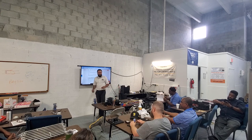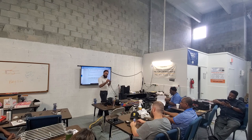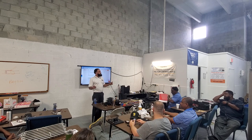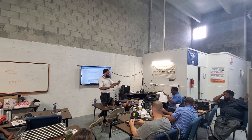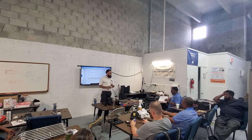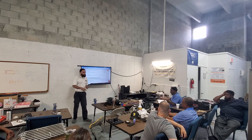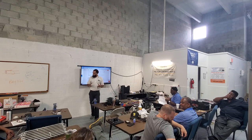That tube in particular, is it thicker or thinner? Do I got any thicker? One more time. Come on, bro. No, I'm sorry, I'm clear. The two tubes that we taking out the compressor, the discharge, is it skinny or thicker? Sure, it's thinner. Good job. And what's the other line called? You, sir. Good job. And what is the purpose of that? The suction line? Yes, sir.